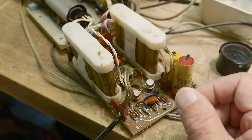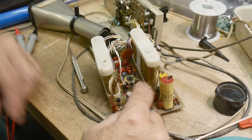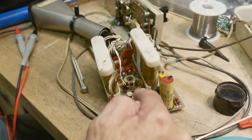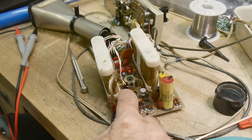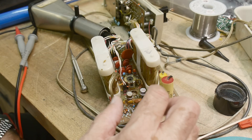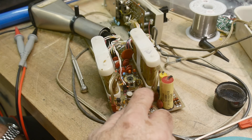I'm going to desolder this entire section, clean it up, make sure all the transistors are good, and put them back in — maybe it'll become stable. So I've reworked this whole section. I've put single-pin gold sockets where all these transistors are, so they all have brand-new sockets — all gold, everything making good contact. There were some pretty dodgy things in there.